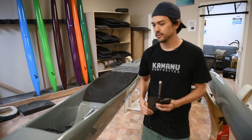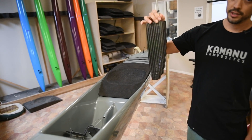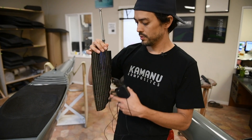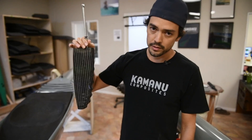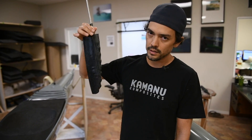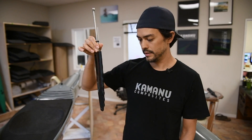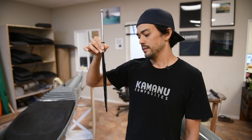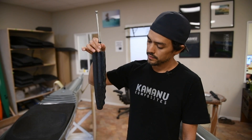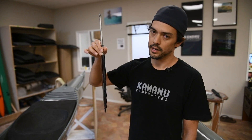The rudder is pretty unique. It is high aspect ratio, similar to our previous rudder, with the addition of tubercles — which is based on academic research on whale fins. The idea is that flow stays attached even at high angles of attack. Most of the time it's pretty similar to our previous rudder, but at high angles of attack the flow stays attached, making it very much like a bigger rudder without the extra surface area — so bigger rudder when you need it, without the extra drag.